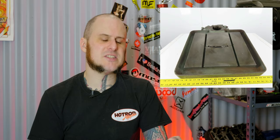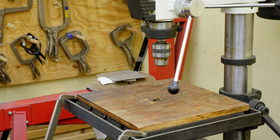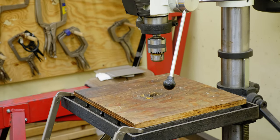We've probably all seen drill presses with Swiss cheese tables where they're drilled into every square inch. That drives me nuts, because if you're trying to clamp a part one of those holes might make the part tilt a little, so you drill in at an angle. If you're drilling through thicker material or a casting you don't have a mill for, that can really screw you up. So what I do is cut a piece of actual plywood — not chipboard, not MDF — to the size of the table and put it on as a drill surface.